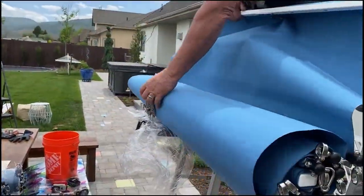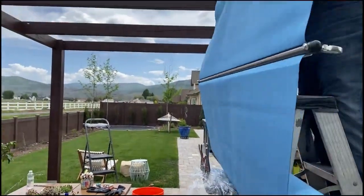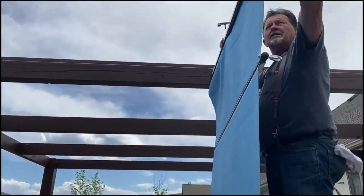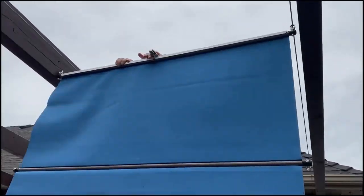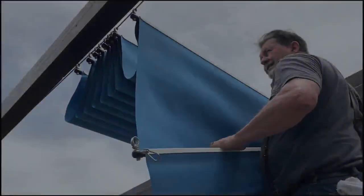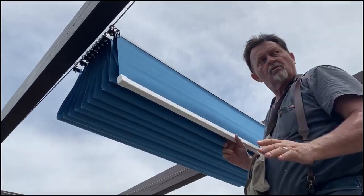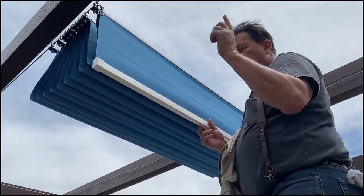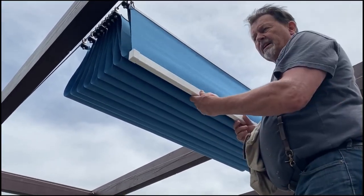Use a vice grip or a long screwdriver with some plastic underneath so it won't damage the fabric as you roll it out. Clip in your shades, making sure the nose hook is on the opposite end from the turnbuckle, which is on the retract end. This shade has a little hang-down valance on the back end so when the shade is retracted it doesn't hit against the stucco and wear out the fabric — it acts as a buffer. Some people like this on the other end as well for added sunblock or ambiance, but it's totally optional and pretty necessary on the back side.